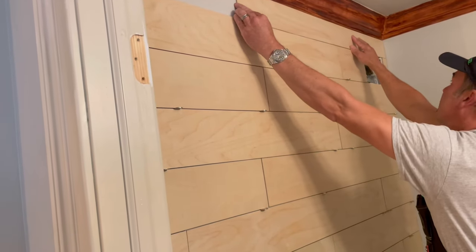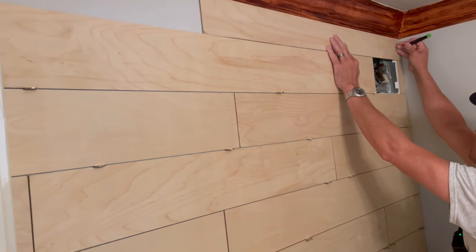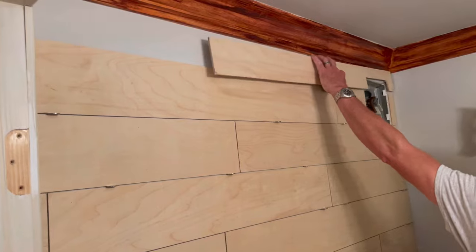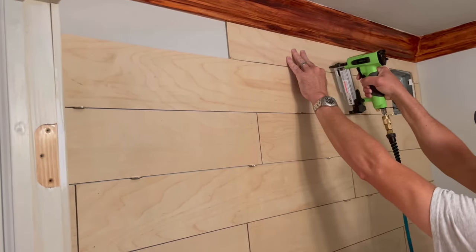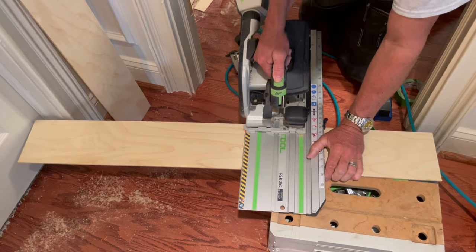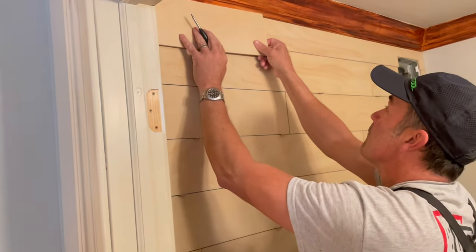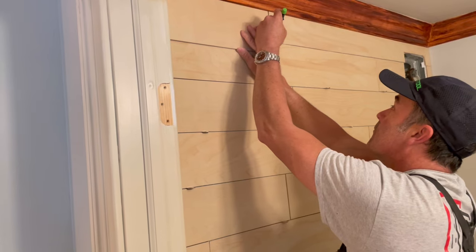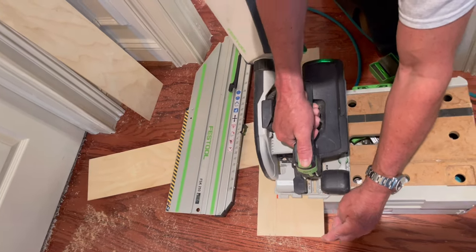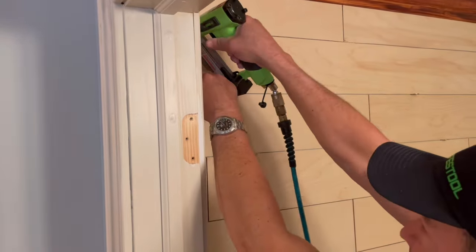I check the fit of the piece and it looks good, so I switch over to the obstruction it's covering and use my pencil to mark exactly where I need to cut — no measuring whenever possible, just make a mark and it saves a lot of mistakes. After cutting that shape I put it back in place and it's ready to attach. It's been about an hour into the install and it goes really fast when you cut in place. I hold the final piece in place, mark each side for width, and cut. When I go to put the final piece in it doesn't fit — but I always know that means I reversed it, so I flip it around and it's a perfect fit.